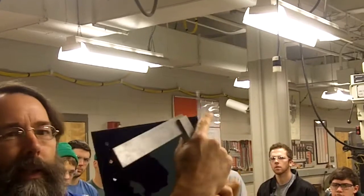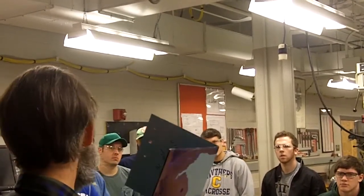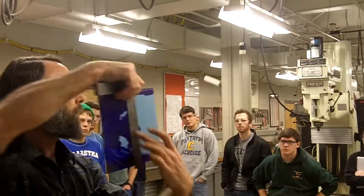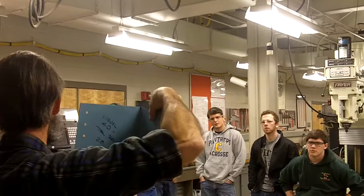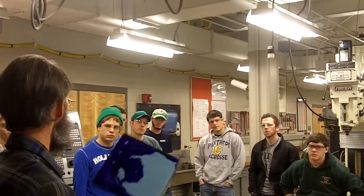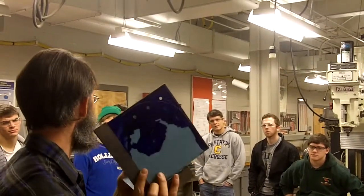And as long as you get it really close, you can go to a sander and sand that. Will it come out accurately? Don't trust the sanding. Work to your line. If you need to, you can put it in a vise and file it down to the line. Once that's done, you can do a couple of things. You can take a combination square, adjust the blade length, and mark your 1.5 inches and mark it over here as well, and then lay it out again. Okay? That's how we want to get that accurate and work that side down.